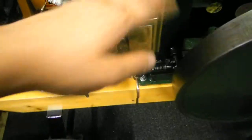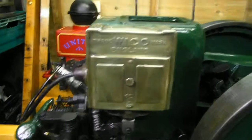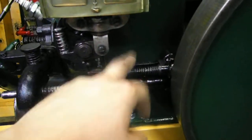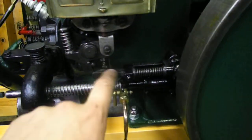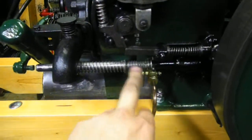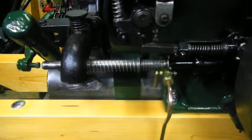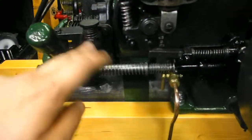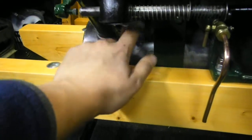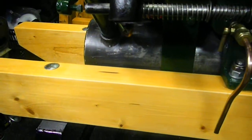The mags had a really good polish, which really brought the shine back because I've never really polished that mag before. I repainted all these bits black again, all the governor striking rods, and left bare metal on some bits. I left that bare metal because when I first did the engine I painted it silver, which the spring running backwards and forwards scraped all the paint off, and it made a lot of mess. All I've got to do is repaint the cart, but it's a bit chipped up, so just give it a coat of black. The fuel tank is back to original standard galvanised, which I've stripped all the paint off and polished up. It will buff up better over time, just polishing it.